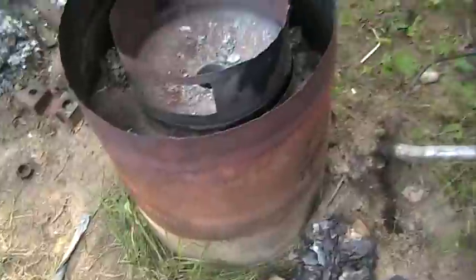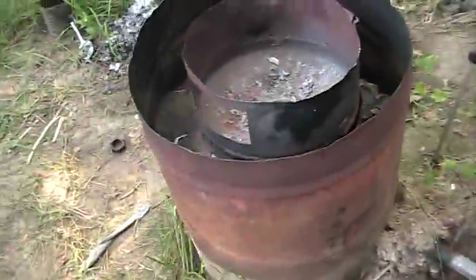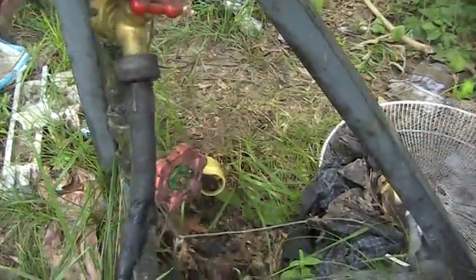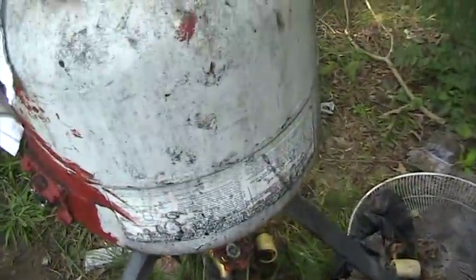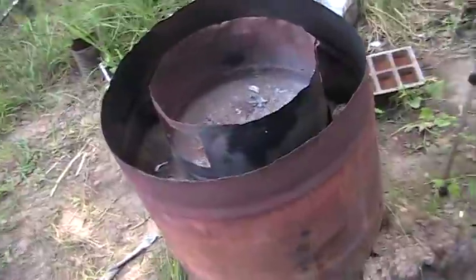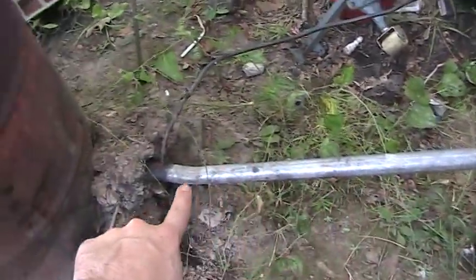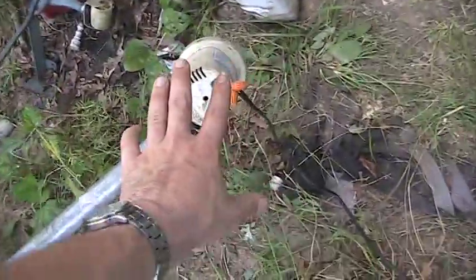This was my oil forge made from just scrap parts laying around. Remember, the only thing I had any money in was just these valves — I actually had the copper in between the valves, and I made sure to buy valves for the copper I had. Now while this burns out and cools down, I will leave my blower on so it's constantly blowing cold air into the pipe, and there's no way the heat can back-draft to my motor and burn it up.